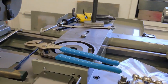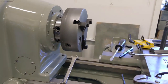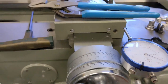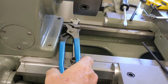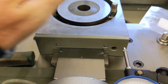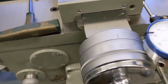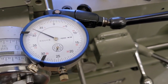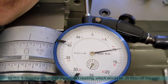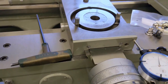Quick update - I have my compound off with a bunch of stuff going on. I went to do my first chips on this thing, but I noticed I had a lot of backlash in both the cross slide and the compound. I decided to look into it. I kind of knew I was going to have to deal with it, but I didn't realize how much - it's about 30 thousandths. You can see right there, that seems like an excessive amount.